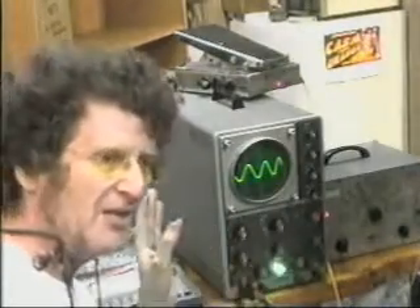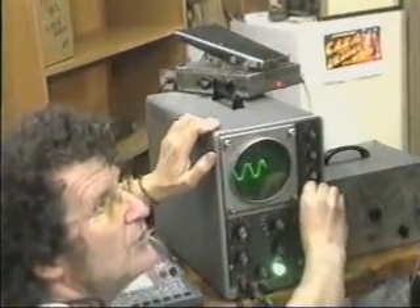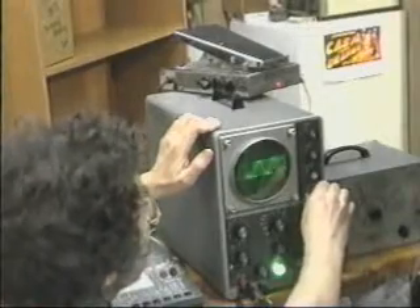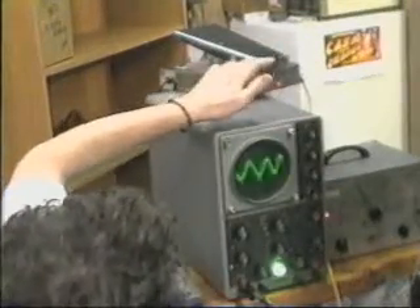One aspect was: how do you fix the oscilloscope? The signal was way over here, and when I turned the horizontal position knob it would go and then creep back. I figured something was wrong with the knob, opened it up, and sure enough there was a resistor end hanging out in space. I soldered that down, cleaned all the knobs with contact cleaner, tightened everything down so they wouldn't shake loose, and gave it the usual fix-it tap — that usually helps tube electronics rearrange their contacts. It's working pretty much perfectly.